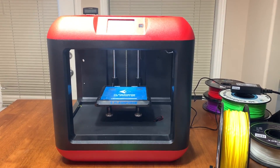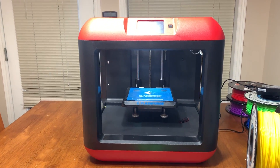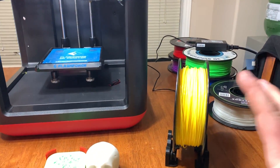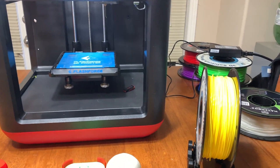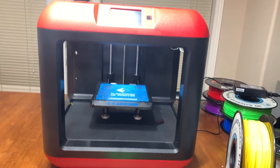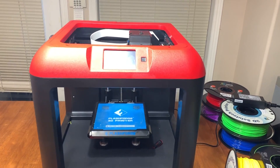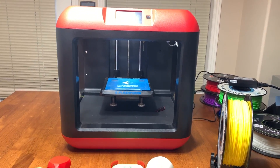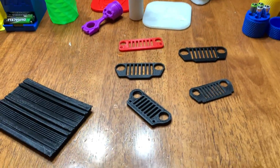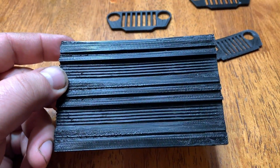Here's where we stand with the Flashforge Finder I picked up off Amazon, and some of the things I printed. Before I got this printer I watched a lot of videos, and what I saw in videos and what happens in real life is not the case. The most important thing with PLA is getting the temperature set — every color is close but each has a slightly different temperature at which it'll print perfect. Also critical is getting the bed level. The Flashforge Finder has an automatic leveler, but that does not work. I downloaded a program that prints squares around the base and I was able to dial in the bed. Otherwise you get warped parts like this gold matting — because it got warped it couldn't print.